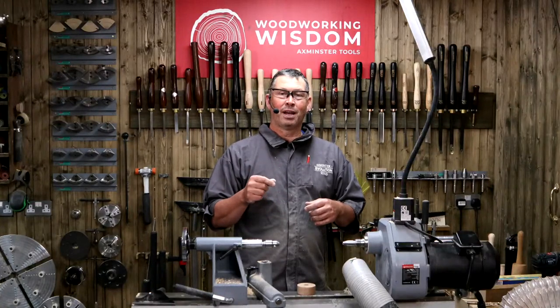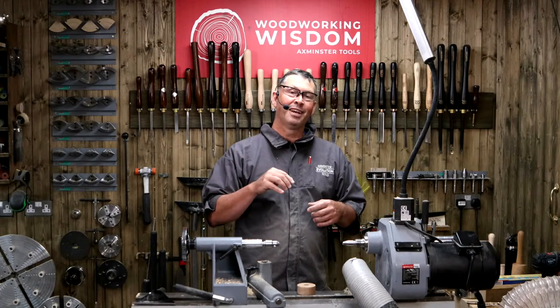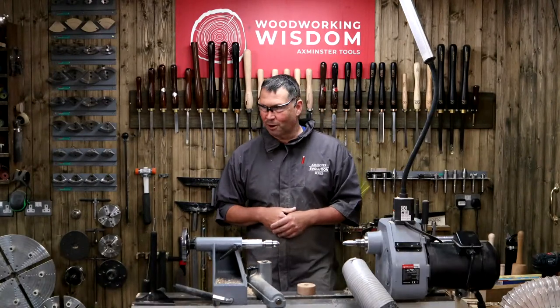Because once your abrasive completely dies, you'll be pushing harder and harder trying to make it work, and it won't, and it'll just keep heating up and heating up. So yeah, just make sure your paper's all right.